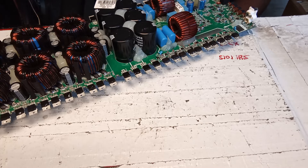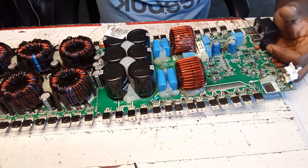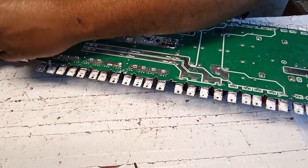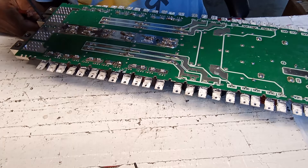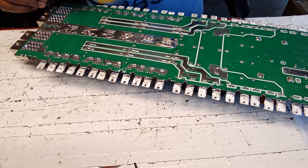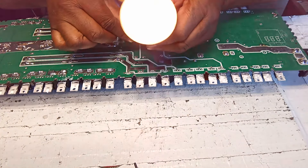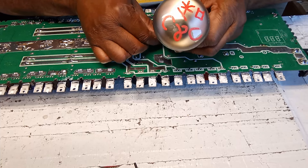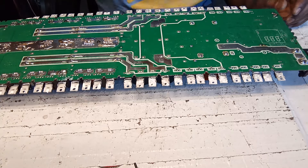I'm going to remove these wires and put this back in the chassis. I also put electrical tape on the meter probes to isolate them so they don't accidentally touch the circuit board and cause a spark while testing. And guys — look at that, this capacitor was still charged even with the amplifier off. I almost got electrocuted right there — can you imagine that?